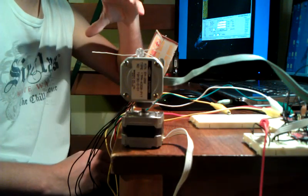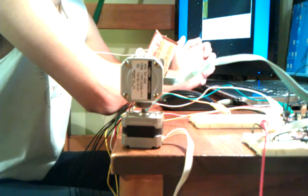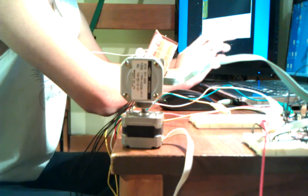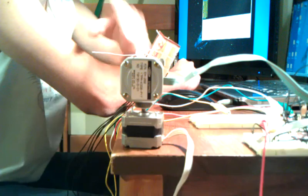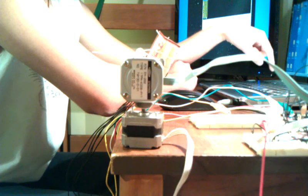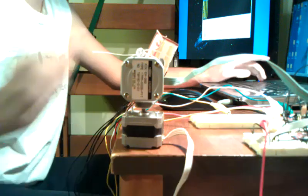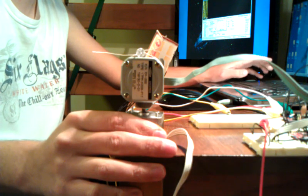Right now I'm not using the stepper motors, I'm not freezing or blocking them with current. Instead, once they've achieved their position, they just turn off to save power. This will be the setup we use for controlling the actual panel, because we don't want to burn energy just sitting there and not changing position. But for this application where I'm physically holding the thing in place, I need to lock the motor. So I have a macro set up for when I push the button 6 on my keyboard, it's going to start locking the motor. Now, if I push 1, 2, 3, and 4 again, it's going to move it, but it's going to have a lot better response back to the original position.